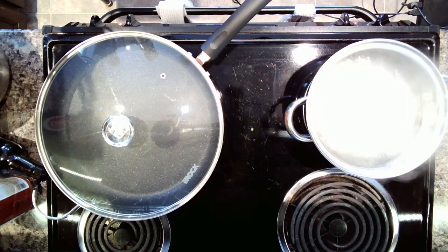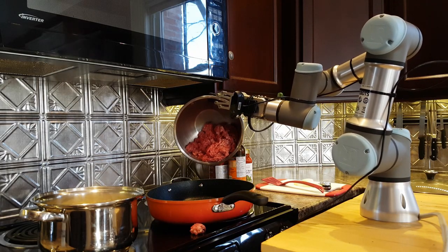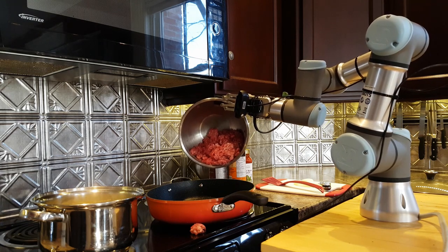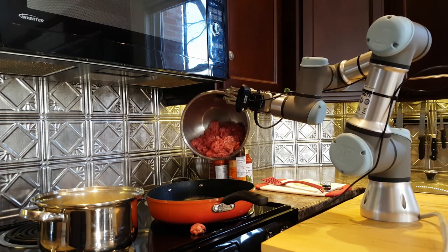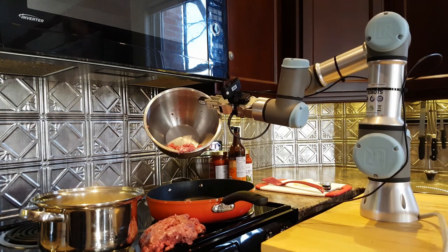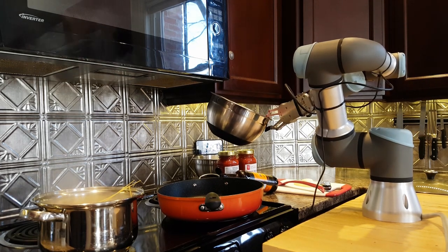Also, there are small quirks with some robot arms, like joints that can turn infinitely in either direction, like joint 6 on Herman. Also, singularities, which all robot arms have. Of course, I didn't deal with any of these. If you get close to them, the arm does some undesirable motions.